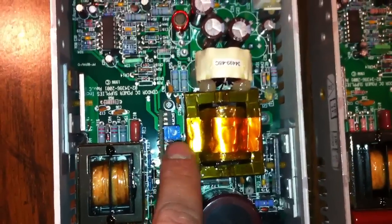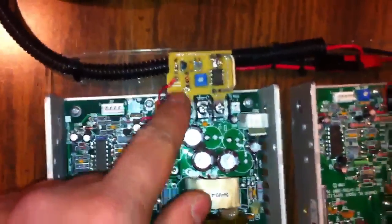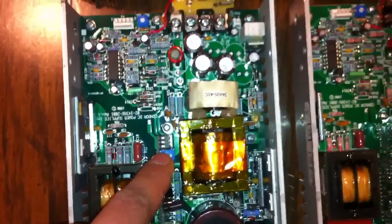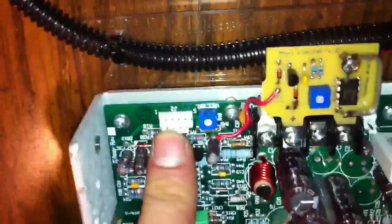They're very well designed — little overview of them. So you've got your fuses here. I believe this is like a current limiter in the supply itself, and this is the voltage. I should unplug it — I don't want to zap myself. This is the current limiter from Fetcher's board; there's also a current limiter in the supply, and there's the voltage adjust. This is that sense plug I was talking about — it's got about 5 pins on it. I was also doing another fuse in there, but they're really well designed supplies.